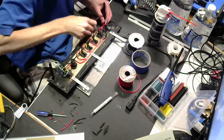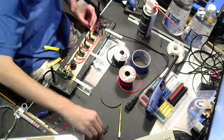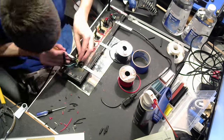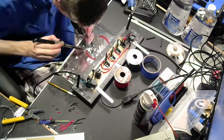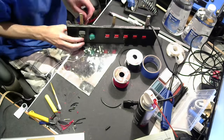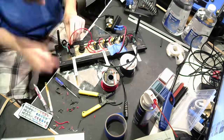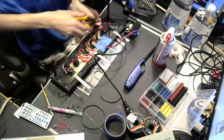The two wires on the switch panel then end at the fourth switch, which is classified as the computer safety, and then the fifth switch, which is classified as computer power, is connected to that. So both the fourth and fifth switches have to be on in order for the computer to power up. From the fifth switch, the power supply end of the NEMA cable is attached and heads to the power supply.